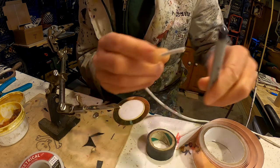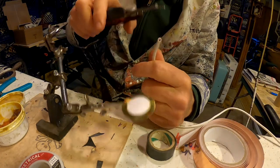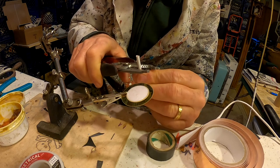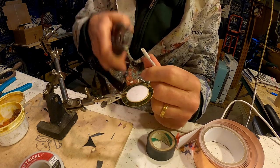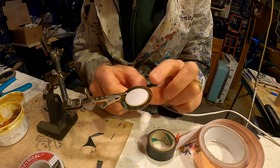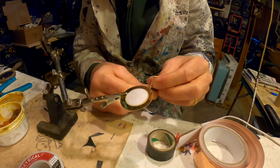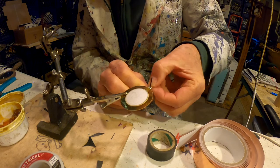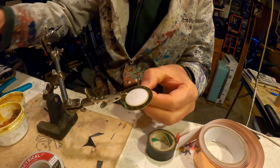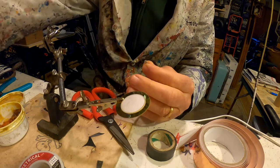Those are marking sounds. And I'm going to get my big wire stripper. I think we're going up to, what is this, 10 gauge I'm going to use for this one. And you kind of clip it around here, then you should be able to pull it off. And hopefully you haven't cut through any wires. Discard the little ends. Oh, see, it's plugged in, right? Hear that? That's that red positive wire going through the amplifier. Pull back the shielding and snip it off with the scissors. Discard it.